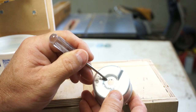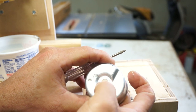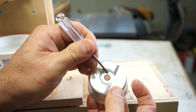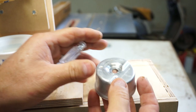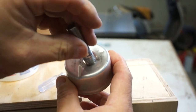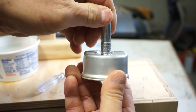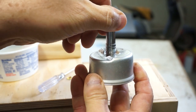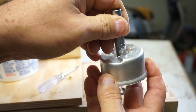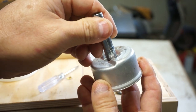Since this is aluminum, I don't think there's a very flat surface on this thing. I wonder if we used RTV — is RTV fuel resistant? I know it's oil resistant. It's got to be leaking right here. Let's put a socket up to it to see how flat it is — I can see little deviations in the aluminum, but that's what the gasket is supposed to take care of. Maybe if we hammer it a little bit to get it flatter and then put a new, thicker gasket on it, we'll see how that works.